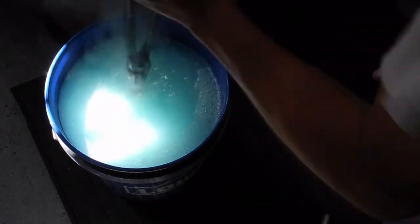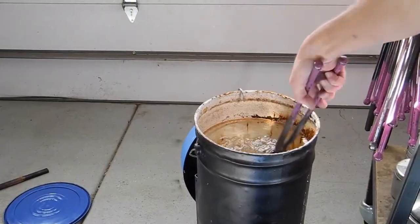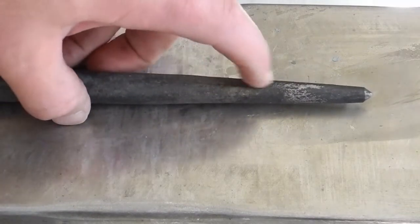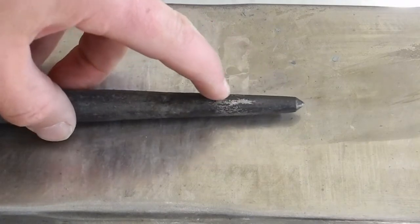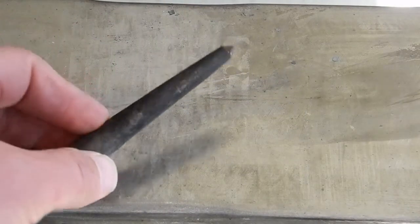You should go back and listen one more time — that sound is what you're listening for. Normally that means you're at a good temperature and the metal has changed properties. Just keep rinsing it, and you can see that's the point at which it changes, where the scale is a little bit different. From there up it should be nice and hard.